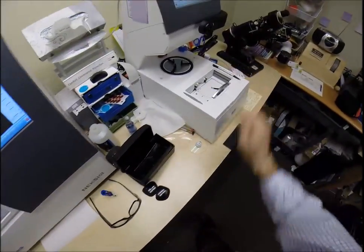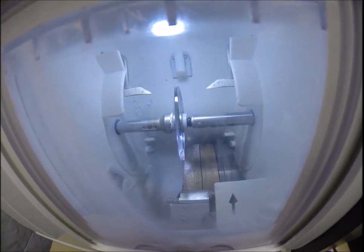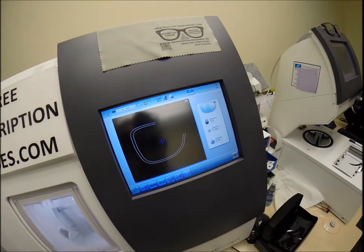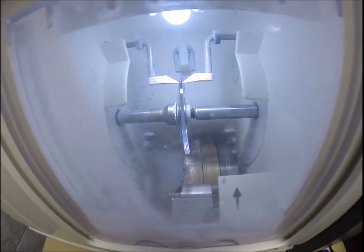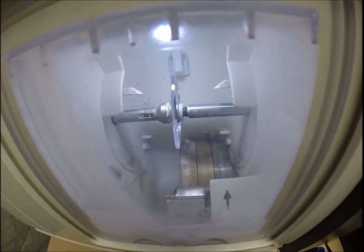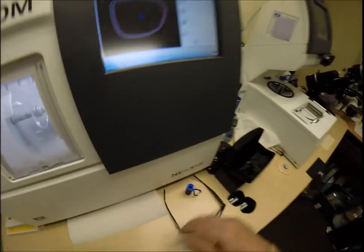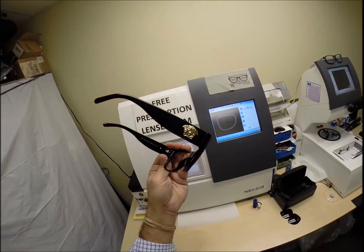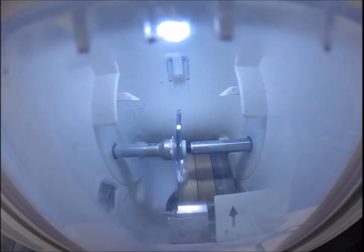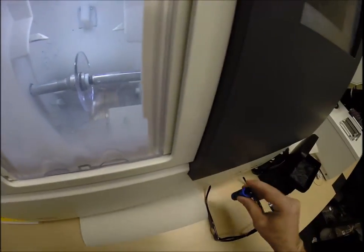I'm going to hit the green arrow, which is start. The door closes, the clamp shuts, and then the lens is going to be traced by the two white styluses, making sure that it's large enough to fit into the frame. You can see as it's tracing out the shape that it's cutting — the old carpenter's saying: measure twice, cut once. It's measuring the thickness of the lens at every point to know exactly and precisely where to place the bevel, so you have the least amount of edge thickness showing — of which you will have none with your prescription, even though it's a large frame.